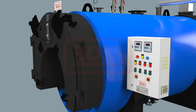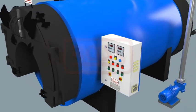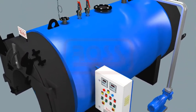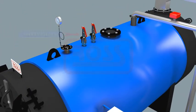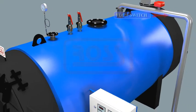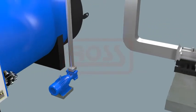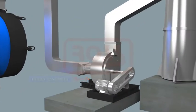The standard Sigma hot water generator consists of a pressure part assembly with furnace chamber and grate bars, a pre-wired control panel box, safeties such as safety valves and flow switch, a hot water circulation pump, and an ID fan assembly.